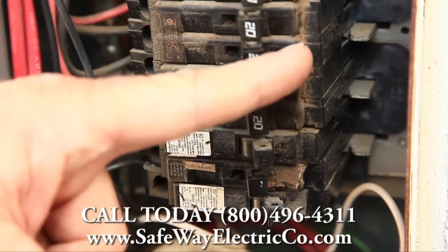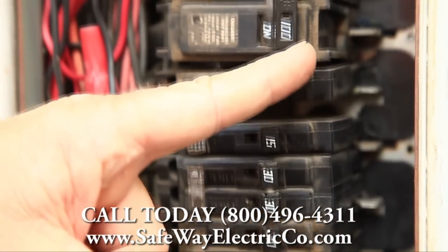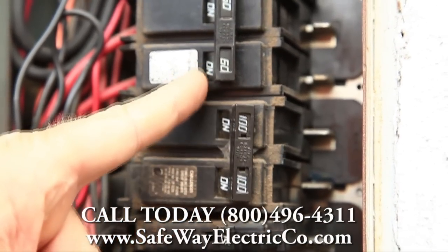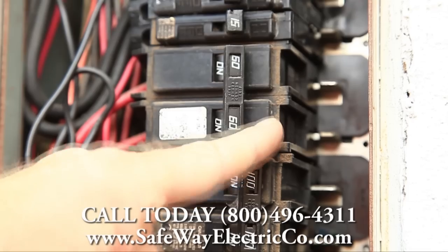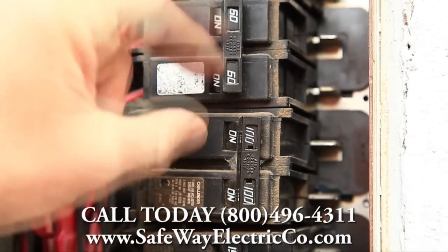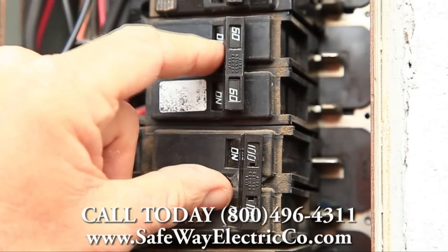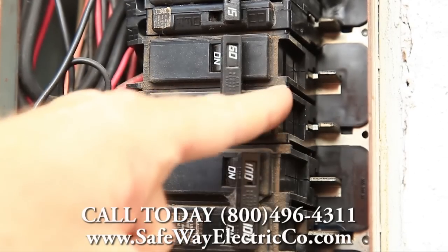Looking really good coming back up, and then we're approaching the 100-amp main breaker again. Heat goes to the top, and the electrician who installed this panel put a 60-amp breaker right on top of a 50-amp breaker. There's already enough heat going through the 100-amp breaker, so now the 60-amp breaker on top is putting a lot of heat in this area, and if you look back in here, this is where all the heat damage is.